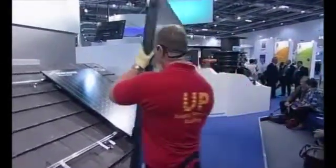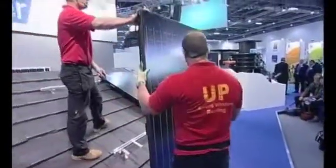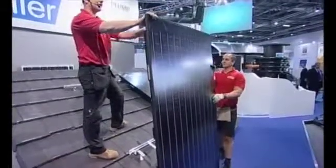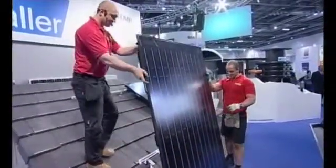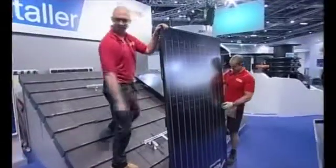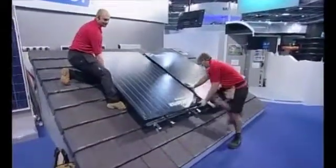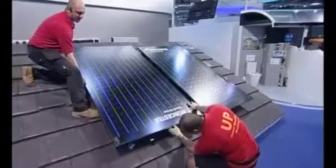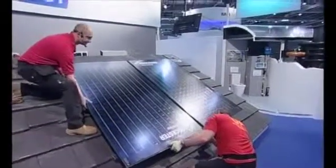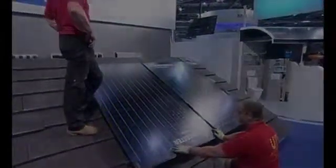The panel is rotated as it's placed — although the writing may appear upside down, the panel is actually being fitted the correct way. The top of the panel, which must always be fitted to the top, has a small hole for a thermometer sensor that monitors the panel temperature and allows the system to function correctly. The panels themselves are supplied without any stickers or markings on the face, so a homeowner wouldn't notice the orientation difference.